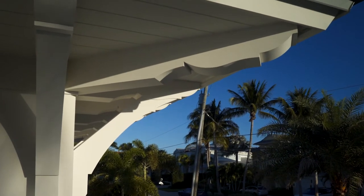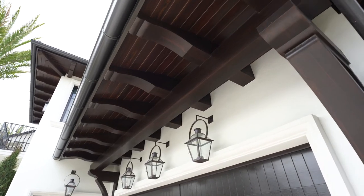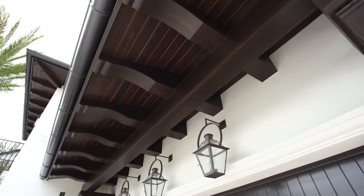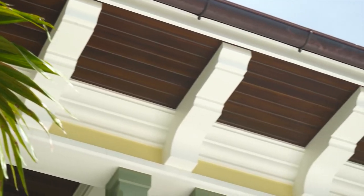When you're doing a bigger overhang or a larger soffit, you do want to beef up your product. You might want to go to a four or five inch wide by five or six inch tall size rafter tail.